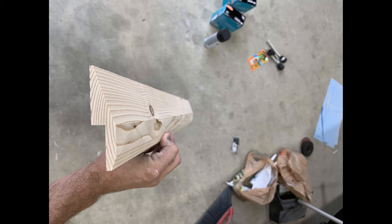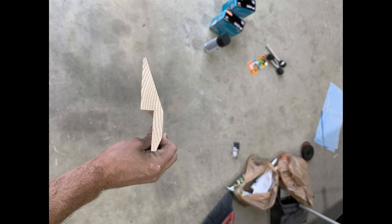At this point I needed a transition from where you're walking in from the shop into the bathroom floor, so I created one out of two by fours. I cut a rabbet on one side and then put a 20-degree bevel on the other side. It worked out perfect — I just used some masonry screws to screw it down to the cement and that's all she wrote.